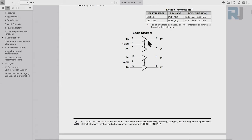Make sure the 5V for the motor is disconnected, then connect the board and click Upload. I'm opening the serial monitor - the program is running. Make sure the baud rate is set to 115200 to match the code. We can now see the PWM duty cycle values being printed.